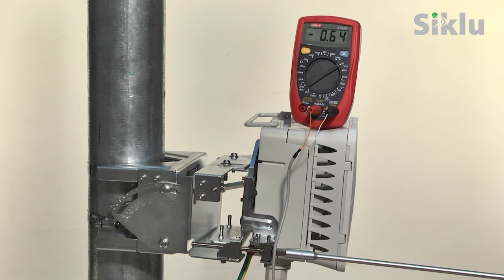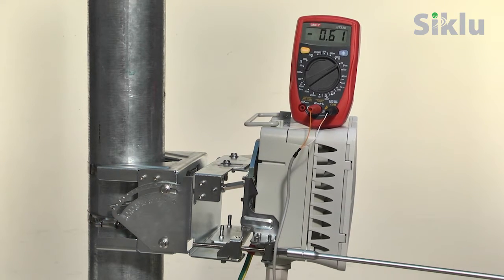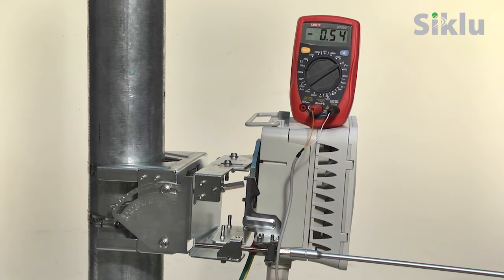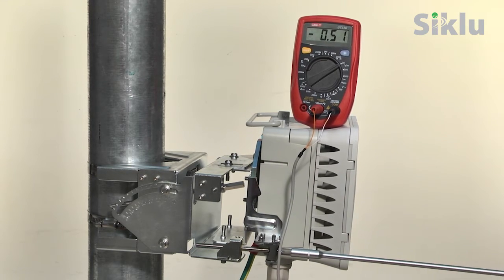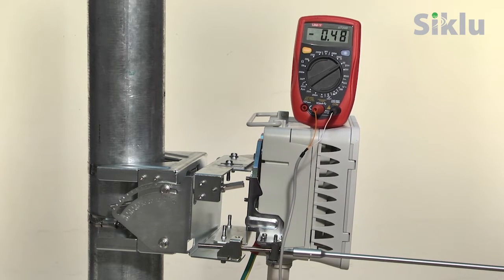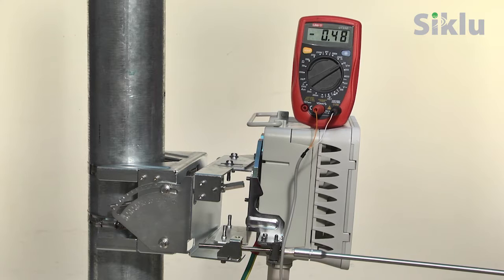The objective in aligning the antenna is to achieve an RSSI which is in line with the pre-calculated RSSI value derived from the link analysis. The target is reached when the RSSI is within ±4 dB of the pre-calculated RSSI value.